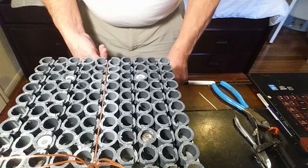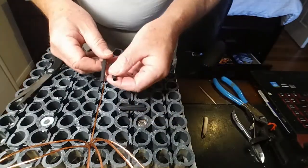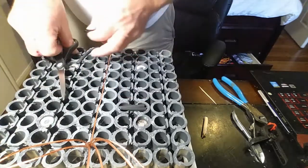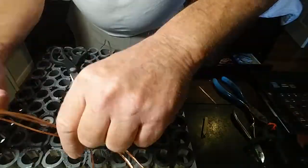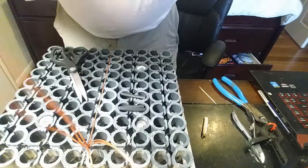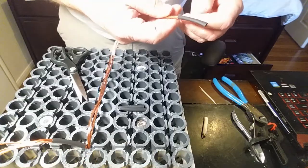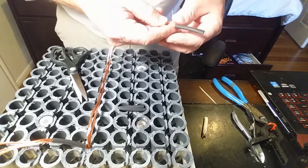This actually goes pretty quick. I'm really surprised how easy it is to put all this wire in this holder — much easier than messing with that nickel stripping. I actually grooved that wider groove wide enough I could have used nickel stripping and soldered the wire to it, but once I stripped this wire down and found these seven coils in it, I didn't see a reason why I needed to use the nickel stripping.